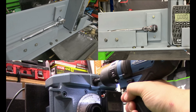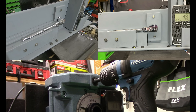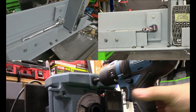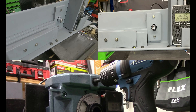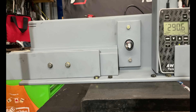Now let's take this thing to failure. We've never used this machine before — this is the first time. With three camera angles set up, we go past 200 foot-pounds and let it go. Going up past 200 foot-pounds, I can feel it yielding. We heard a snap. We'll check if we broke the yoke pin. Lots of flex — we ended up at 290.6 foot-pounds on a flex head ratchet, and it flew literally 10 feet in the air landing in a pile of metal, chiming like a bell.